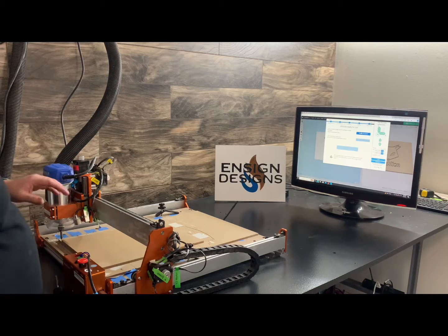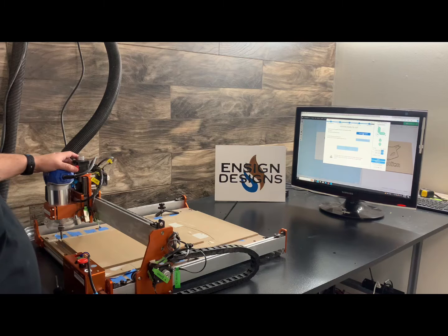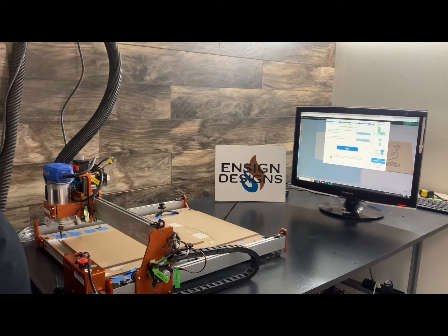Here we're going to be setting up the XY0. So this, you want it all the way to the corner of your piece of material. This will ensure that your projects are centered, or as they appear in your program, whether it's Easel or whatever program you're using. So this part's very important. Okay, so once we have our XY0 completed, we're going to move on to the next step.